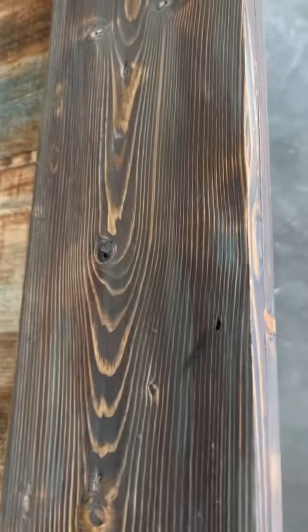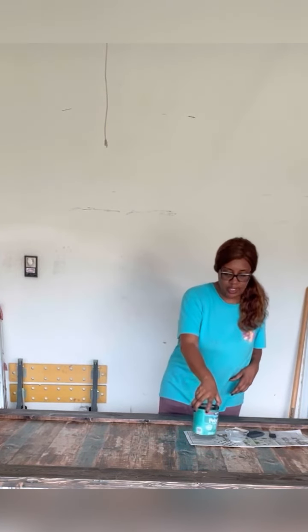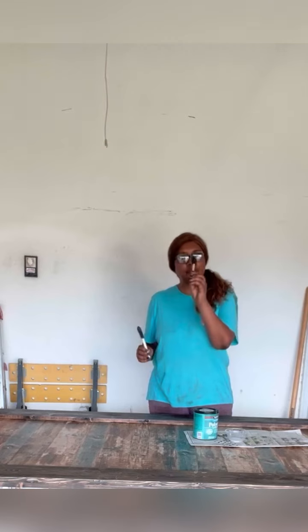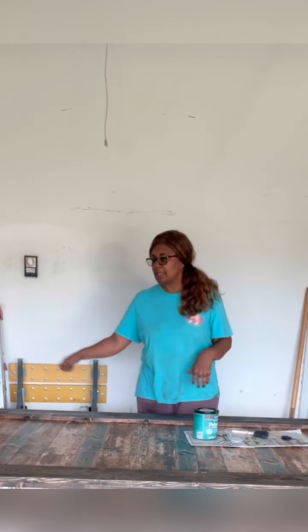Okay, so now it's time to just polish off the finish with Minwax water-based polyacrylic, which is what I'm using to just seal it and protect the wood. And I will use a wide foam brush and a very small foam brush to get the inside edges of it. And the back of this, or the bottom of this, because it's lying down, it's stained, and I did not go in and do the blue to color the stain and sand it off and all of that. And I don't plan to do that because of where this door will be hanging. No one will see the other side of it. So I just left it with the provincial wood stain color.